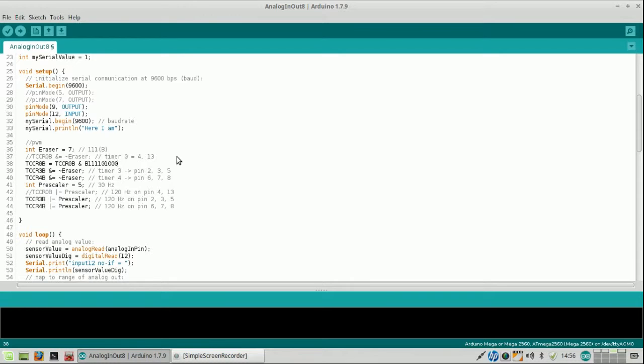Now I have to keep in mind that I do this exactly correct, which I don't at the moment. This is correct. And now it's correct because it should be 4 and 4. And then pipe. This is bitwise OR. 1, 2, 3, 4, 1, 2, 3, 4. And this is setting 1 for 62,500 hertz. And this is how I do it, how you should do it.